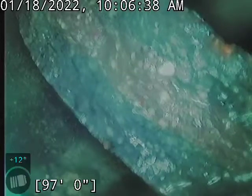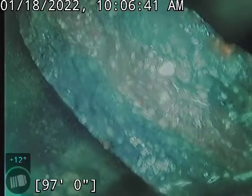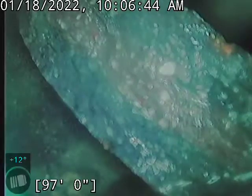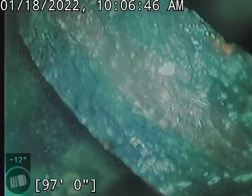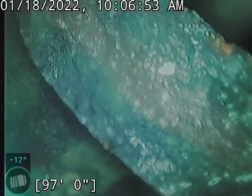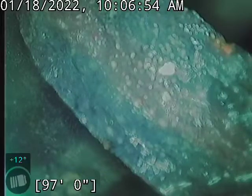It's David Fuller, Ridge Plumbing. I'm at 1217 Dodge Court, making a dirty movie down here in the basement bathroom. Currently out 97 feet, and that's as far as I can get. I've got a pretty significant offset here where they've tied back onto the clay line.